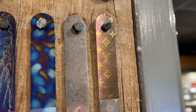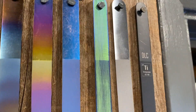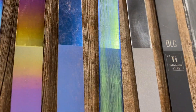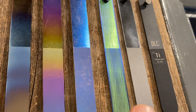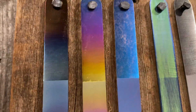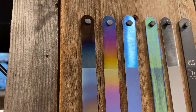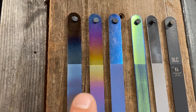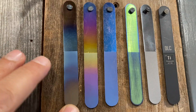With the laser you can do all types of different techniques — you can go back and make separate colors, as well as doing other effects like a distressed look, where an emery board is taken to the first color and then you go back and hit a second color. Or this tumbled finish here, which undergoes the same type of process. The cool thing about electro-anodization is you can fade it from color to color, moving the titanium through the spectrum on the artist's side.